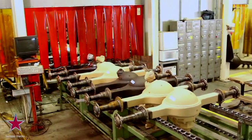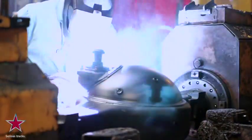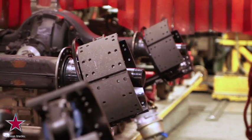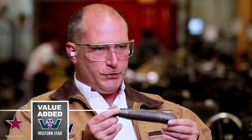This is the beginning of the Western Star axle line. You can see the rear axles lined up, ready to get their suspension brackets welded. We are certified by every axle builder to put on our own suspension brackets. We have so many different suspension options with Western Star that we cannot get all the axle manufacturers to weld on brackets and get them to the truck plant in time. On the axle assembly line, axles are getting their shafts installed, brake spiders, brake chambers, brake drums, hubs, and ABS sensors, and they are getting their springs put on.